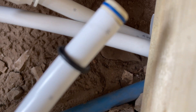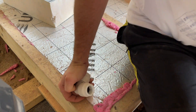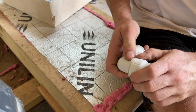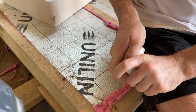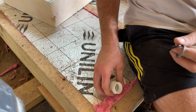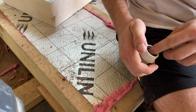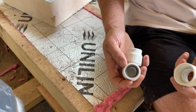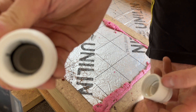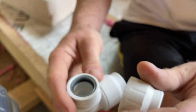I'll also check an existing one. What I have here is a 22mm elbow — I'll show you how it's constructed. This one's fresh out of the packet. If you take these apart, which you need to do to disconnect any connections, it's much easier to see. You've got the plastic washer and then the rubber O-ring. From the inside you can see: washer on the outside, O-ring on the inside, to create that airtight watertight seal.